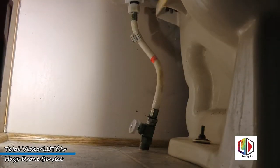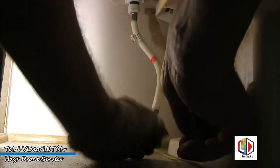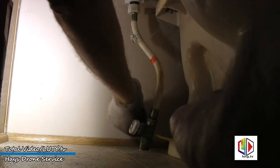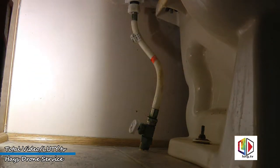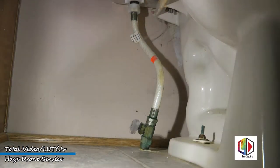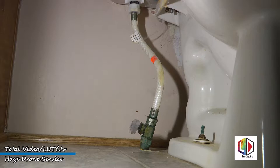I'm a little concerned about the new toilet fitting because you're supposed to measure from the wall out to the center of the bolt, and it measures 11 inches. Technically the new toilet is a 12-inch rough-in — that's what they call that measurement. Toilets come in 10, 12, and 14 rough-in distance from the wall to the center of the toilet flange. They said if it's in between sizes you need to go down a size.